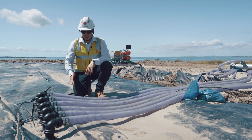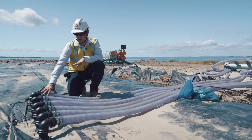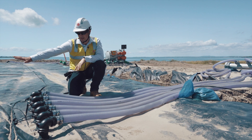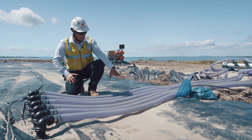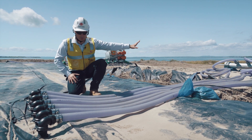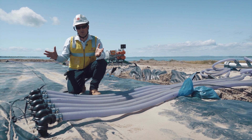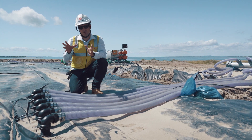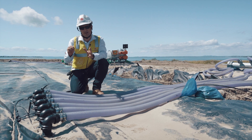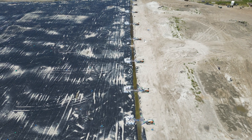What we have here is a welded seam where the liners have been welded together, and then the connection points where the vacuum pumps — so this is a vacuum pump here — is actually connected to the membrane and underneath connected to the wick drains. What is really interesting is you can see some of the water within these pipes being sucked out by the vacuum pump, but it's not a continuous flow of water. The confining pressure within the soil matrix has drawn out the free water and is now applying that pressure to the soil matrix, so we are still seeing some of that free water come out of the soil and basically the water is drawn out and removed from this parcel of land.